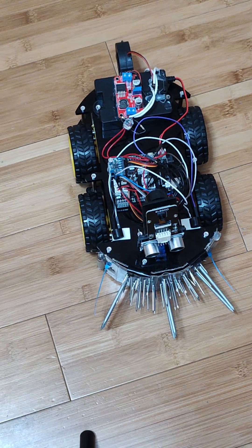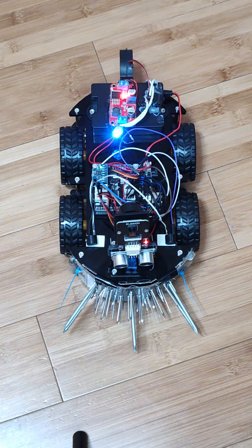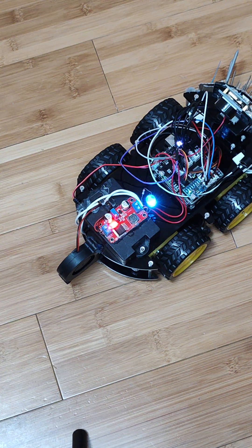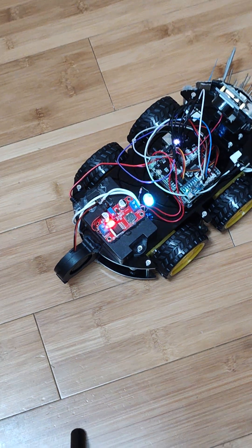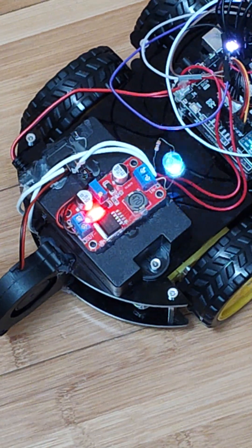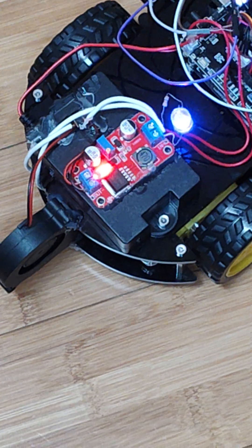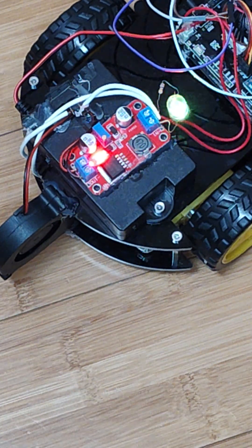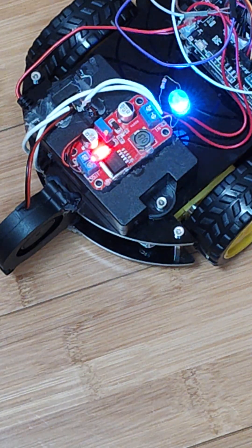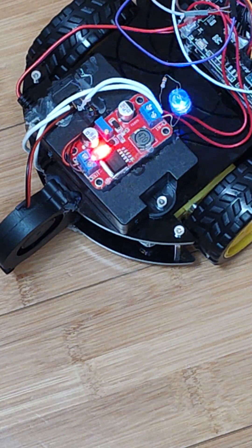Let's get it turned on. We have a fan on the back, and then the small circuit which has an LED on the input side, just to indicate that it's on. This small circuit is actually a boost converter to increase the battery voltage, which is between 8.4 and 6 volts — the range for a 2S lithium ion or lithium polymer battery pack. I'm not sure which because it's not written anywhere on it, and I can't open it because it's plastic welded.